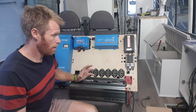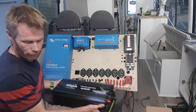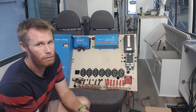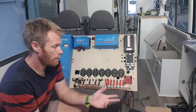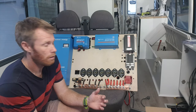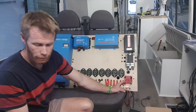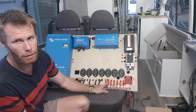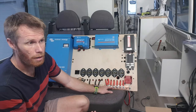Stainless steel bolts — nice and clean, no rust hopefully. So what I've done: we have four batteries, 160 amps each, 12 volt batteries. I've connected them in series and then paralleled that. The main battery cables will come up, and over here we have the positive side — they'll go through this switch, which will then provide live power to the bus bar. The bus bar I made out of just some scrap copper plate, 10mm thick, 100mm wide.